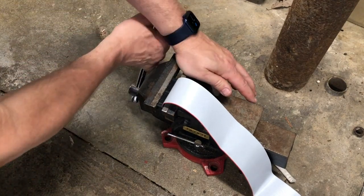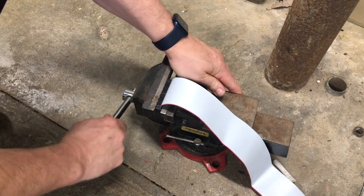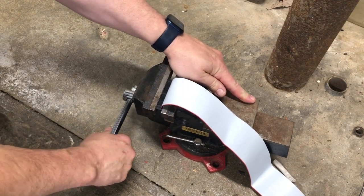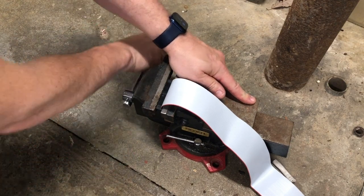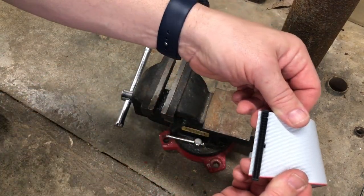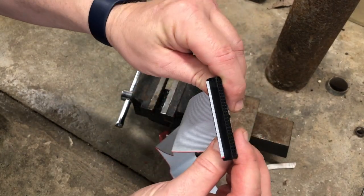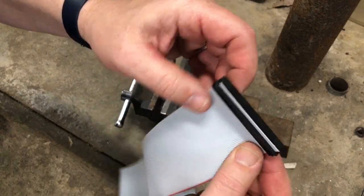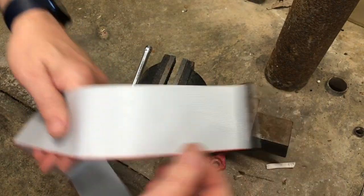I felt it cut in. You gotta keep going. Go too far, you'll end up crushing the connector. There. Let's see how that looks. See, no damage. You don't see any gap, no teeth, so it's pressed down completely. With any luck, this should be a good connection. So that's one end.